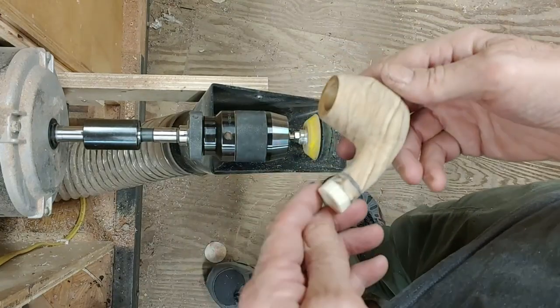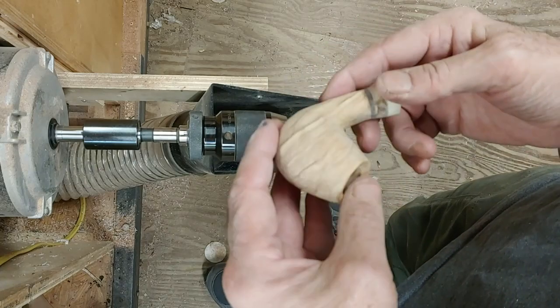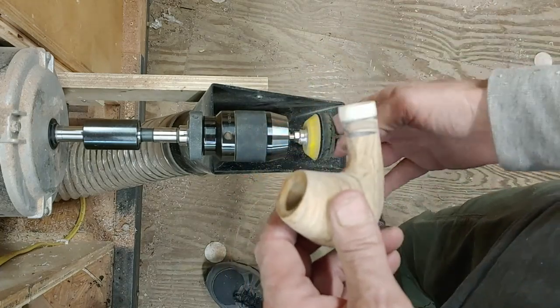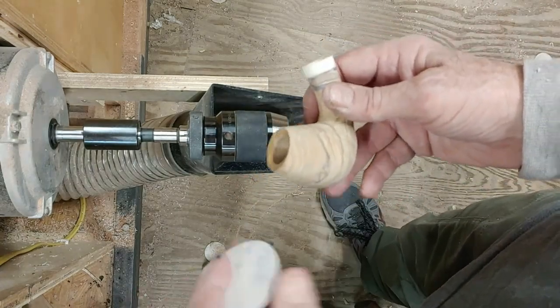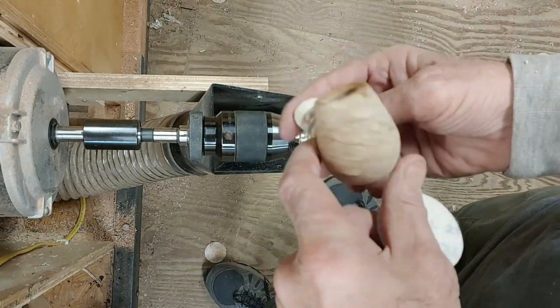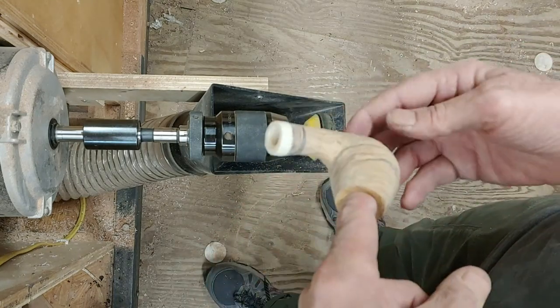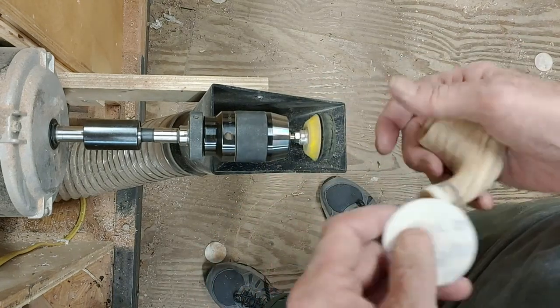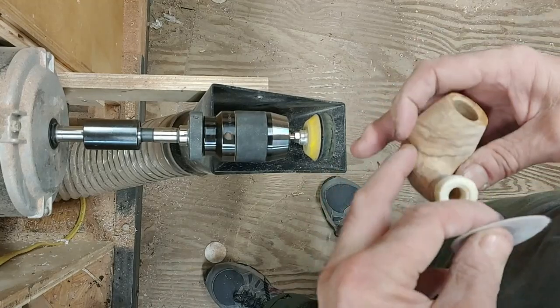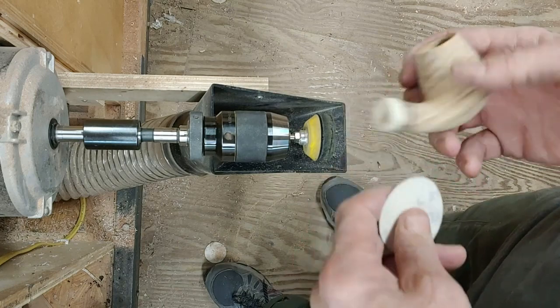So I took the liberty of doing all the gross shaping on this rather than subject you to all that time of grinding away. So what I'm going to do now is begin working the finer shape on this. It's still kind of heavy, so I'm going to be taking more off. The idea is to remain as concentric as possible about the center of this. And so I'll be using an 80 grit on a smaller cushion wheel to keep reducing this down and getting more defined shape, especially around the neck. So I'll go ahead and record that. You'll see how this goes.